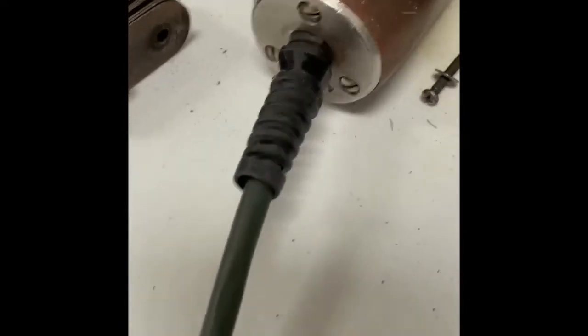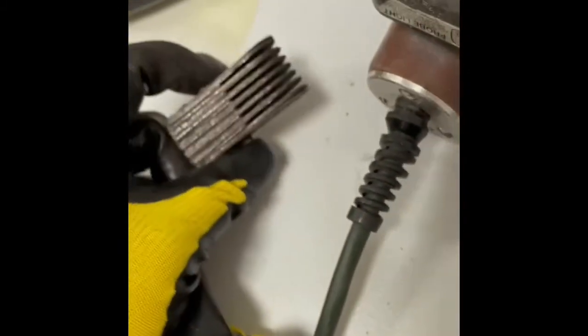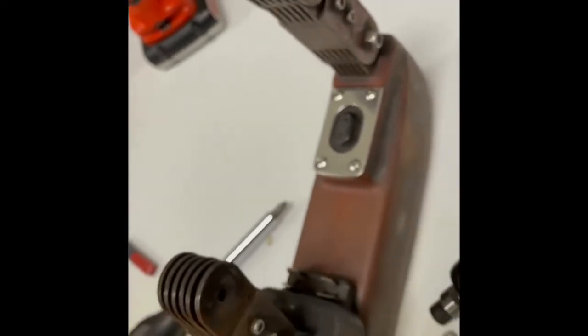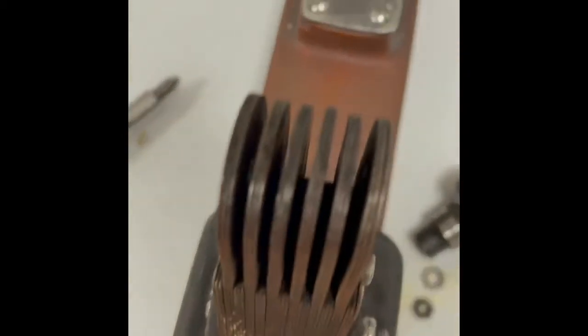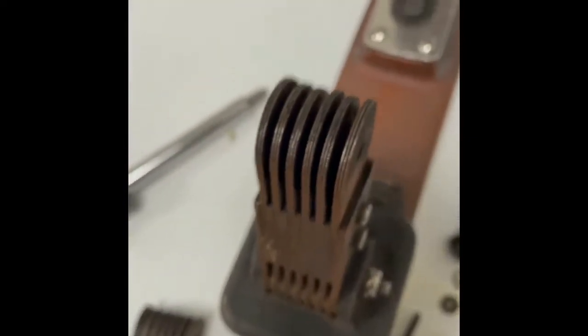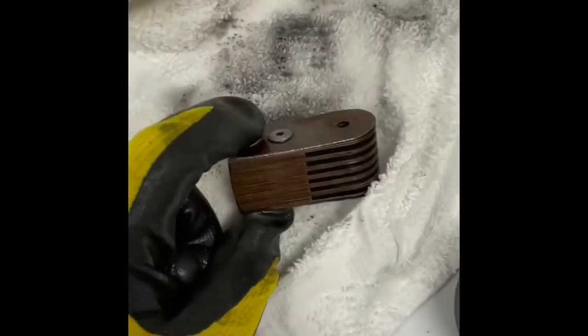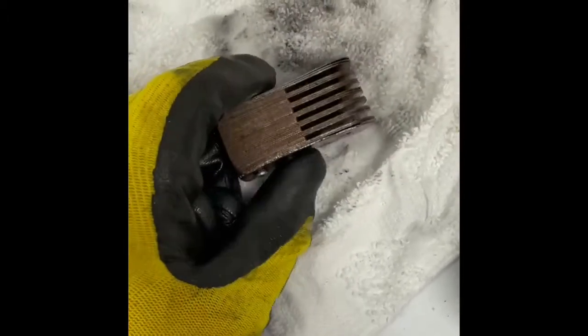As you can see, we've got everything screwed back in the housing. One of the things we're going to work on now is maintenance on the legs. We're just going to take this out, clean in between the slots, and grease them up so that the legs can articulate. Usually what happens is people will switch between dry magnetic particle testing and wet magnetic particle testing, and the dry powder will actually get clogged up inside these grooves. So we're going to clean those up using a solvent cleaner. You can use acetone or drop the legs in acetone or any type of cleaner solvent. Just make sure that you apply a little grease — you can use WD-40 — just to help articulate the legs. The main thing is make sure that you do not screw this in extremely tight when you reinstall.